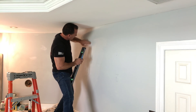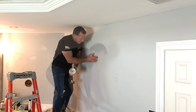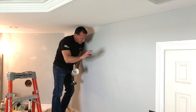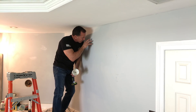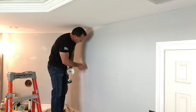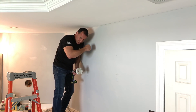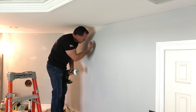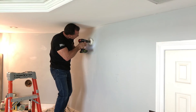We have a mark. I'm going to drill it out. My wire is over here — I already disconnected everything and I just tucked my wire back in the wall. I know it's away from this but I'm still going to be very careful. I have a stud right here, so I'm going to be very careful when I drill this not to just plunge through it. I'm just going to lightly hit it until I get past the sheetrock and then I can fish the wire right through here.